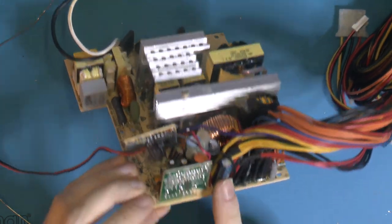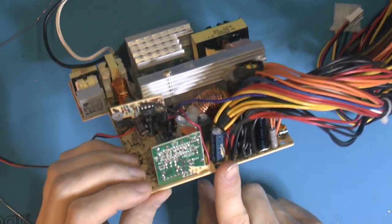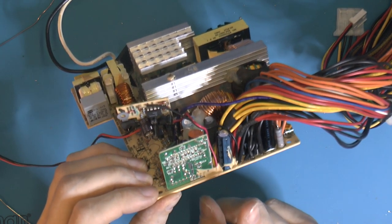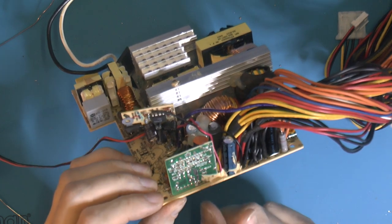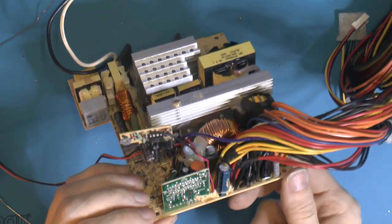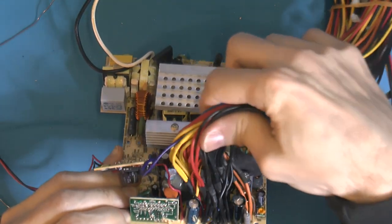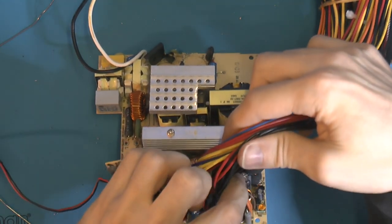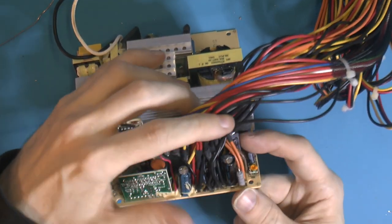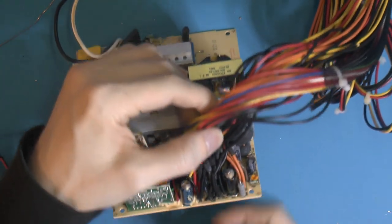So the problem I'm having here is that this is 3300 microfarads at 10 volts. I don't have that. I have less or more, and the more are the bigger ones, 12 millimeters. These are 10. And I don't know what this one is. That's another one, 3300 behind there, but a different brand, which is kind of funny how they have two brands.